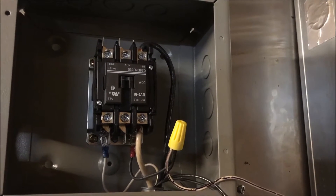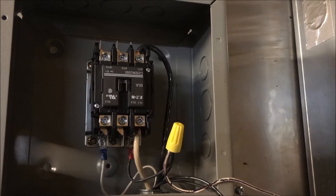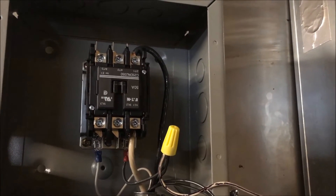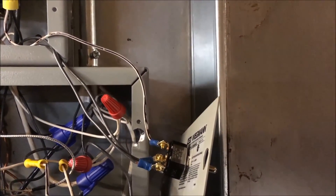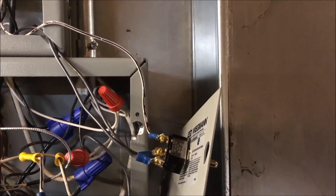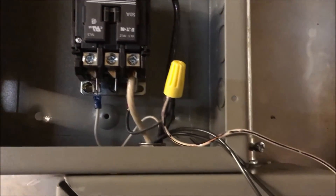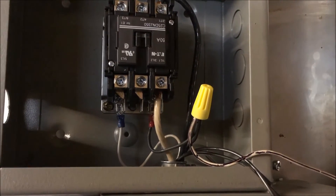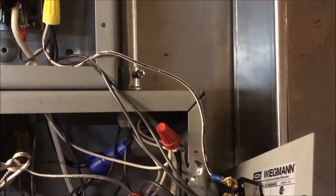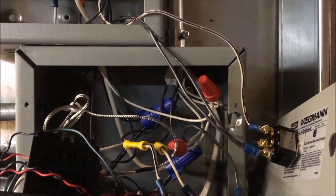Here's how I have this Eaton contactor set up. If you read upside down there you can see the part number. It's a three-pole contactor, which is three times as much as I need, but it's what they had. I've got this switch wired up here, and in the middle the common is the hot 120. I have it wired up so that — this is a 120 coil on this relay — I'm going to put some thermal paste on this and mount it that way. And then I also redesigned the control panel here.